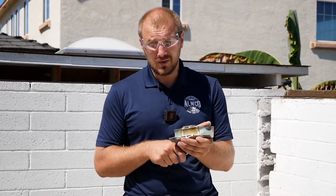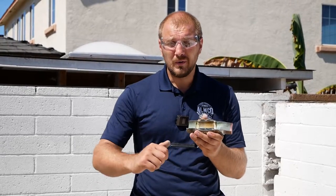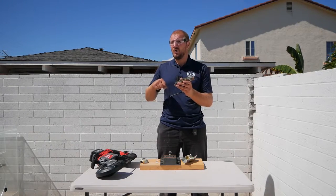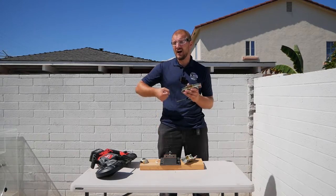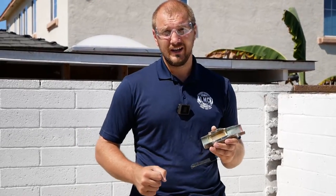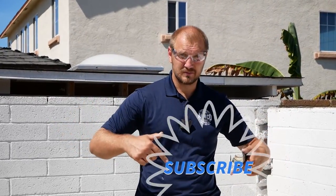The most important thing to know: always leave the valve 100% on or 100% off. If you exercise the valve — turning it on and off at least twice a year — it will make your valve last much longer. Thank you for watching the video. Subscribe to the channel and watch our other videos.